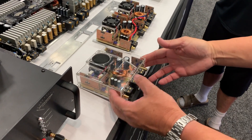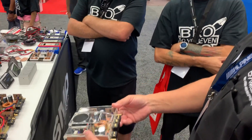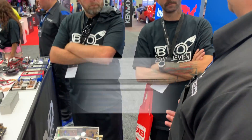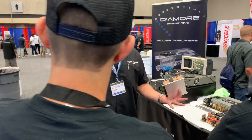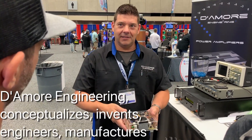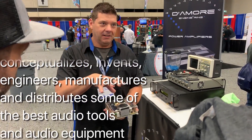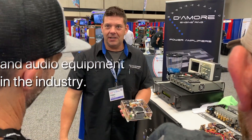This kind of came from Mercedes' new AMG V8 engine. I'm a fan of those cars and they have a new V8 where they've reversed the layout completely so that on the outside of the V are the intakes and the center of the V is the exhaust, so they're able to put the turbos right in the center. It's got a quick exhaust pipe coming off the top — it looks like a diesel when you see it.